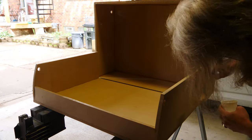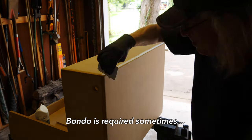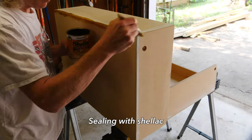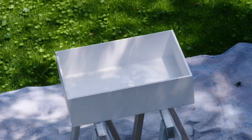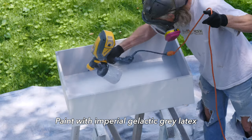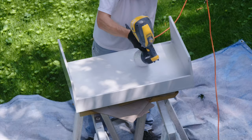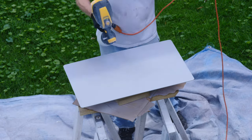I need to seal all the MDF edges, and here I'm using some thinned-out wood glue, then coming back and putting some Bondo on the edges where things aren't totally flat. Afterwards, I'm going to seal the entire outside of the box with some shellac and then prime it with Bin primer. Finally, it's going to get a very light gray imperial latex finish that I'm spraying with this Wagner power sprayer — link in the description below. It actually works pretty good and I've started to use it more and more.